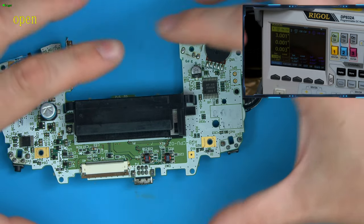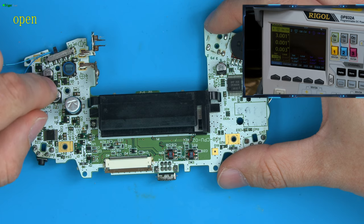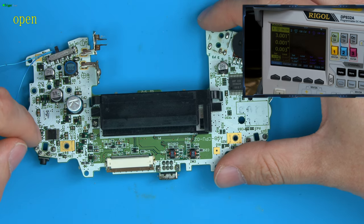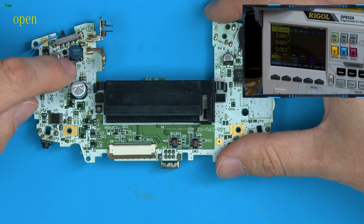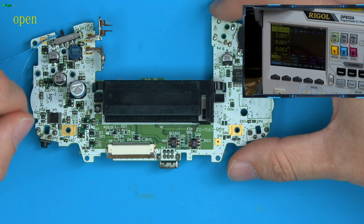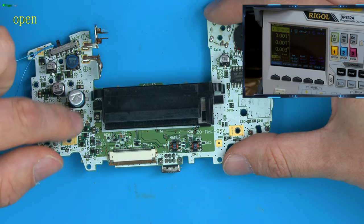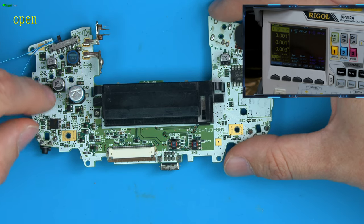So when I'm looking around boards, you typically find that near the power supply, you'll find big caps or big ceramic caps. Normally a black chip, which is your regulator, sometimes inductors like this. You'll start to get familiar with how certain patterns of certain things look. So this is a classic power regulation area, and this kind of layout of components is typical power regulation.